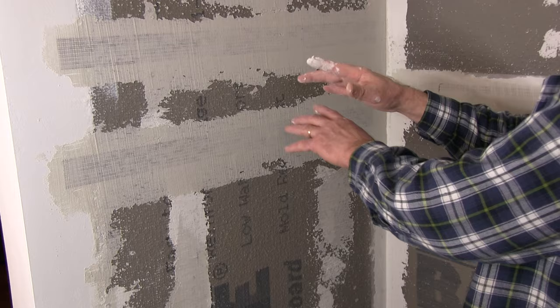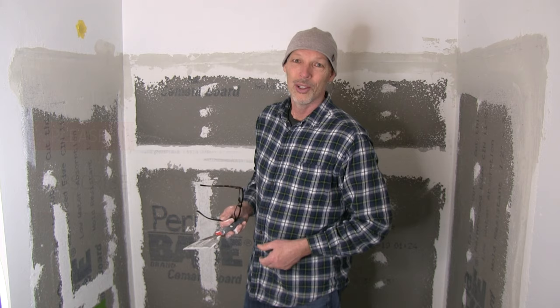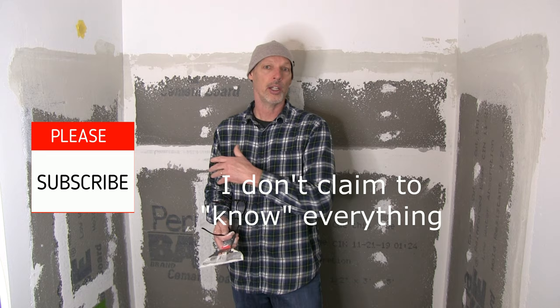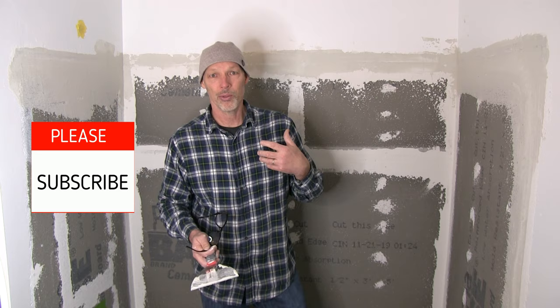Do you think this will do anything or is this a waste of time? I've got the mortar and the tape, so I might as well put it there and see if it reinforces that sponginess. I think we're good now. We're going to let this dry and cure for 24 hours before we apply the RedGard. Thanks for watching — leave a comment below. I don't do this for a living and I don't claim to have everything figured out. I've watched a lot of videos and out of all the professions, tiling is one where you can't get people to agree on much of anything — they all have their own way of doing it. I'm just trying to follow what makes sense for my application.